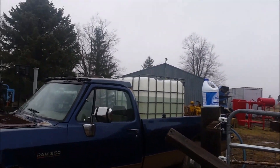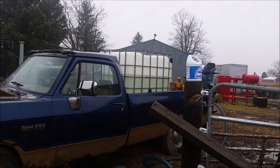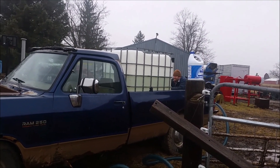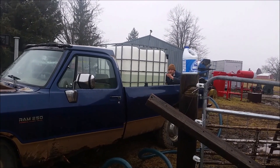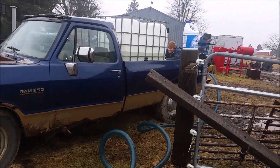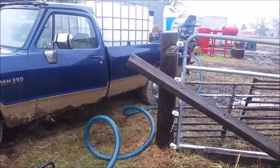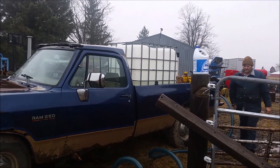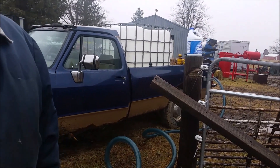Hold that and I will time it — on idle. It's already going! I knew I had figured it would only take a couple of minutes, if that. In another video I mentioned we went with this trash pump — they were clearancing them out at Family Farm and Home and they were about $166. I had priced these at Menards recently and it was $200 to $300. We needed them for pumping water for irrigation. 50 gallons in 30 seconds on idle, with the choke still on — so about two and a half minutes at idle for the full tote.